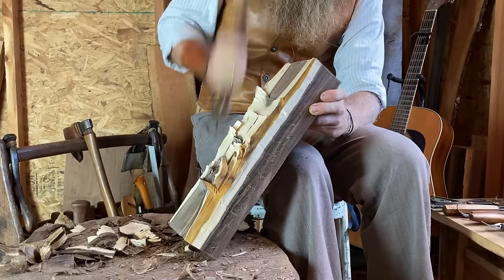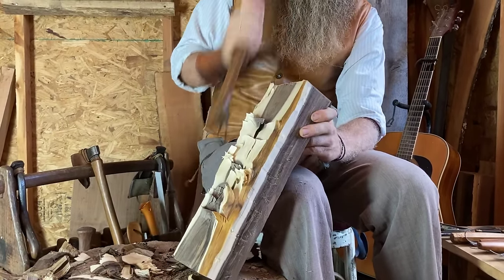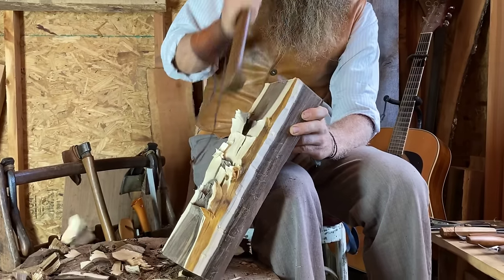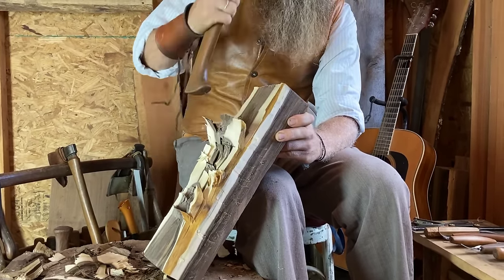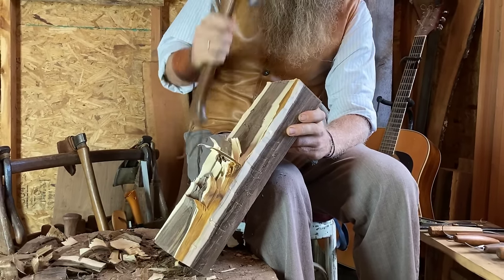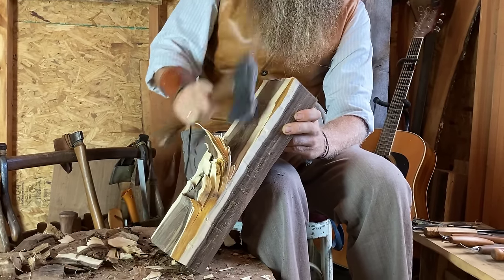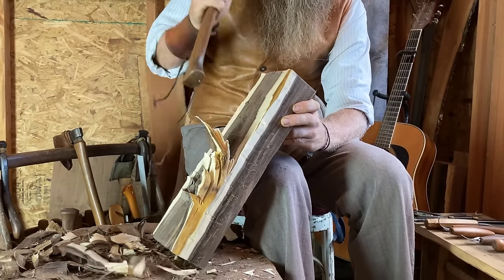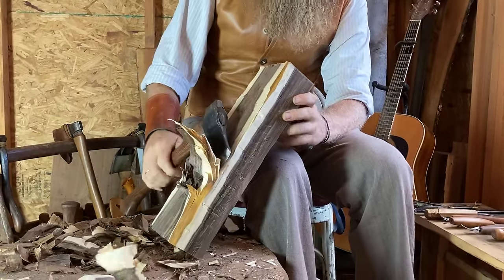Notice that I make these scores right here — that enables all of this wood to come off a lot easier. If you just start from the top and come down, your hatchet will get stuck every time and it takes too much energy to get nowhere. If you make those nice scores, you're more successful. Throughout this whole video, we're going to approach it the same way every time by making those nice scores.